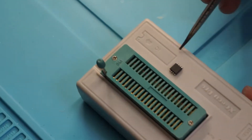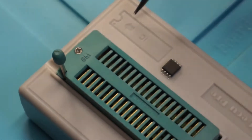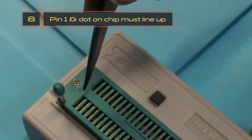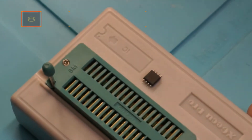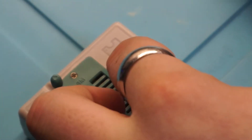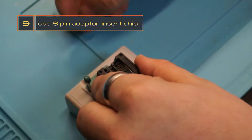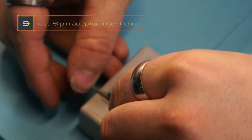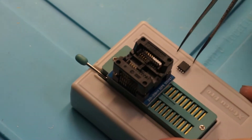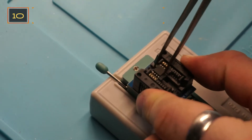There are some instructions on here. This is supposed to be a representation of the IC — it has pin 1 in the upper left corner from our perspective. That correlates to the dot on the chip. The dot always indicates pin 1. So we have this little nifty adapter. We're going to put the chip in there — nice and solid. Then we press down, drop the chip in, lift up, and wiggle it a little with our fingers.